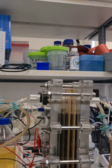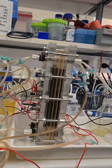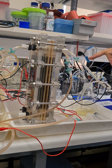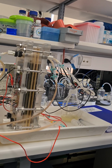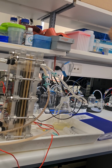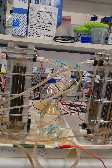I can see still a lot of turbidity inside, even though it has passed through the ion exchange membrane, right? This concentrate looks like the turbidity is still there. I think that one has been having some hydraulic issues around it. When the concentration goes above 20 grams per liter nitrogen, you no longer have turbidity because bacteria cannot grow. So this is still because of bacteria, right? Yeah, it's still below 15 for that. I see.